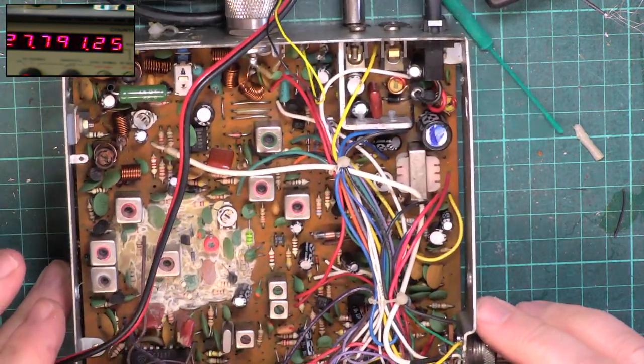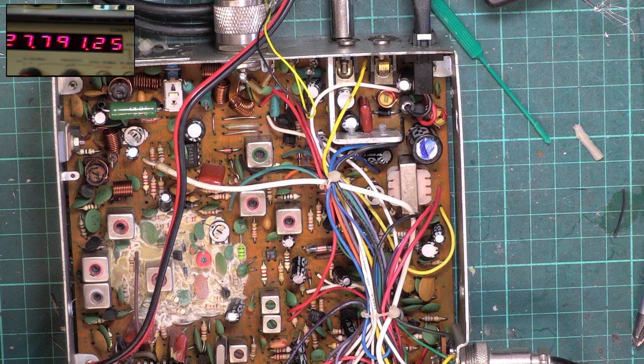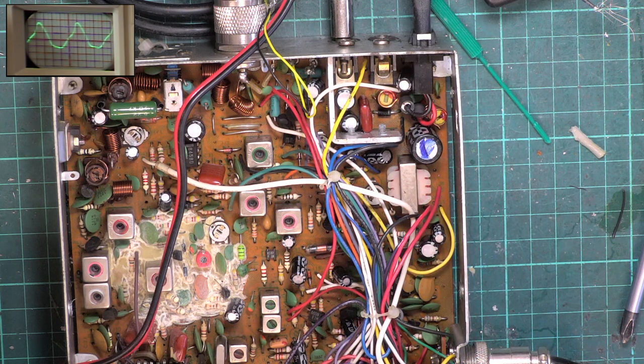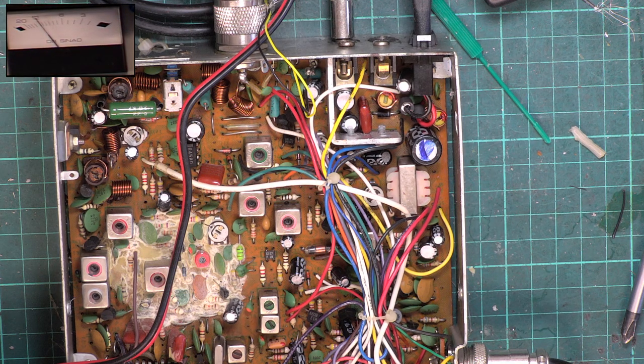That sounds awful. It's 0.3 of a microvolt. It's 100 microvolts, and it looks awful on the oscilloscope. How awful is that? So it sounds like the detector's miles out. About 12 decibel SINAD. Let's see whether we can quickly do the IF.